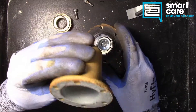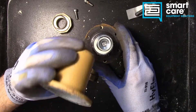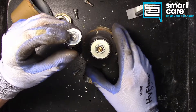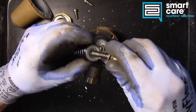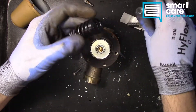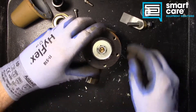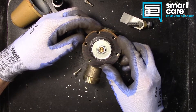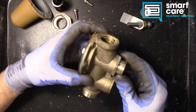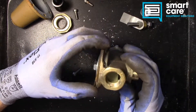So it was a pretty long bolt, but it has now taken all the spring pressure off, so we can pull those last two bolts out without any risk. This is the top cap or cover, and you can see some of the rust around the edges there where it was leaking. We've got our little cup that our bolt was threaded into, pushing down on the spring — it is a pretty stout spring. Then we've got a gasket with a diaphragm assembly and some sealing surfaces here.